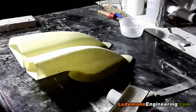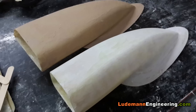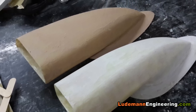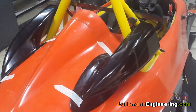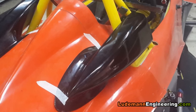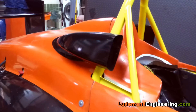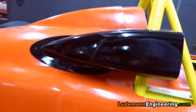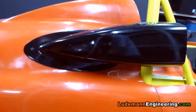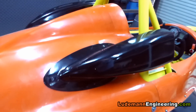There we have two of them — repeat for the second one. Now there's the auto body putty being used to fill in, and then we sand and fill, prime and fill, and then paint. We mount it on the car, starting with a couple of clecos holding each one in place to get the alignment right, then glued it down. Here's the finished result.